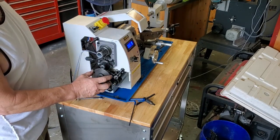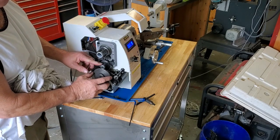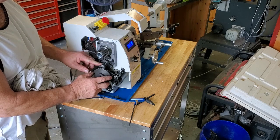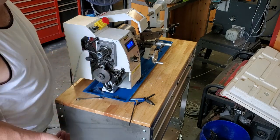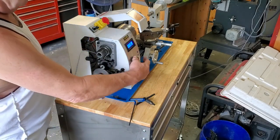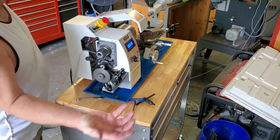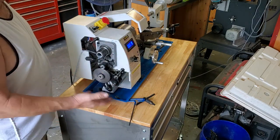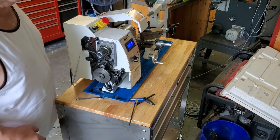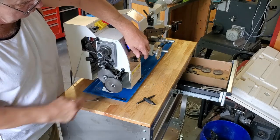We drilled that detent like I said, got this sitting a little higher, which moves this gear a little farther away. Now the howl is still from the motor, but that little bit of chatter you hear from the gear is okay. Next we're going to do the other gears — the intermediate gear and the first large gear for the lead screw. You always want to have some play in here; if you fit these tight they're going to be noisy and wear fast. Put just a little bit of wheel bearing grease on it. All we've got now is normal gear noise and of course the motor still howling.